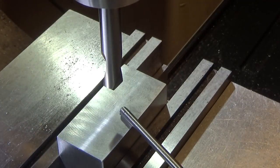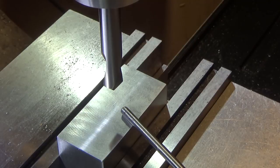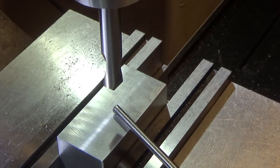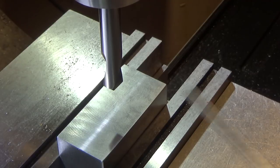So the shaft of my hydraulic press is actually 0.7 inches. But what I'm going to do is drill and ream for half inch. I'm going to make an adapter on the lathe so that I can use my half inch reamer to make tighter fitting dies in the future, if that's what I end up wanting to do. Although this is only a 6-ton press, and I'm thinking about getting a larger one, but having a standard size seems like a reasonable idea, so that's what I'm going to do.